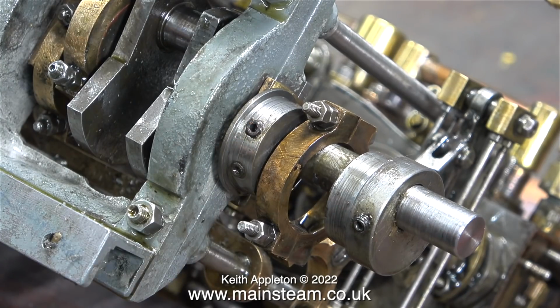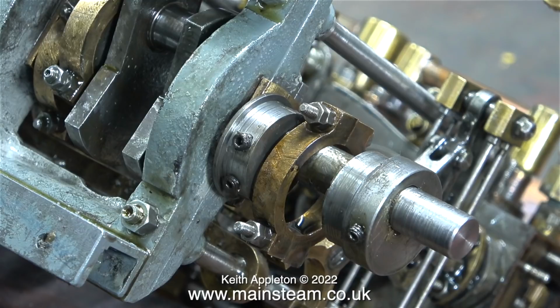Normally these eccentrics are machined as pairs, and on a triple expansion engine, the centre pair of eccentrics have a different offset. I do like the idea of making each individual eccentric sheave adjustable. What I'm going to do for the inner eccentric sheave, where the grub screws are buried underneath the eccentric strap, is just use one and drill a hole in the eccentric strap so I can get an Allen key in there to adjust the eccentric without removing the strap.